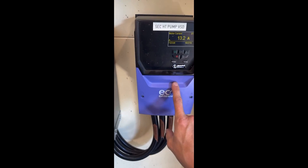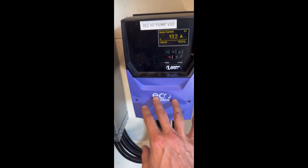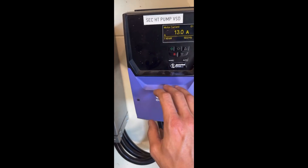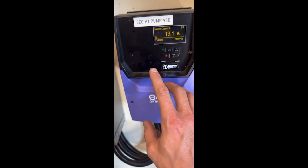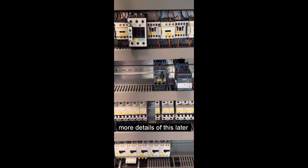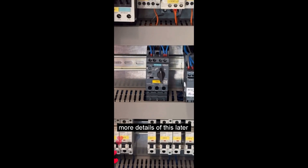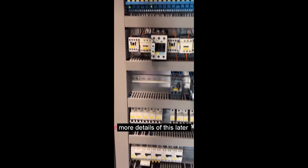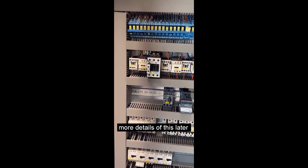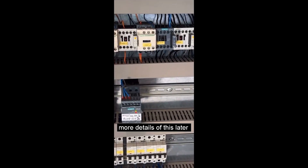This would not work when I got here. I was getting some really mad voltages on the bottom end of it and I couldn't work it out. I plugged into the software, looked at all the stuff, and it all seemed okay. It was proper throwing me. So after consulting the drawings, I found out that an overload feeds it and it goes from that overload to a contactor which controls it.